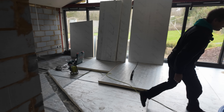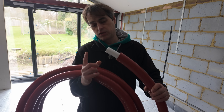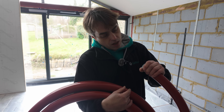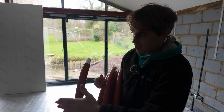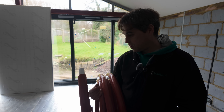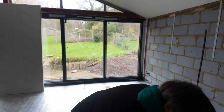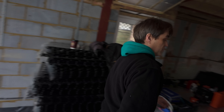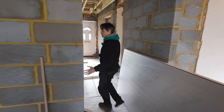This is the pipework we are using — one of my favourite for this kind of application. This is multi-layer composite pipework, which is an aluminium core pipework, insulated, that will go nicely into that channel we've prepared for it. The plant room and cylinder will go right here under the stairs.